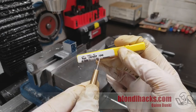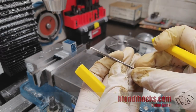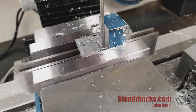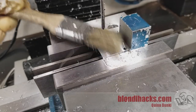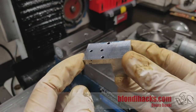Next I'm going in with an eighth-inch undersized reamer — it's 124 thousandths, so clearly one thou under one eighth — and I'm going to ream all these holes. The idea is that all of the pins are held in this side of the fixture and they're all a one-thou interference fit. Now I can just deburr those holes and it's starting to look like our part.